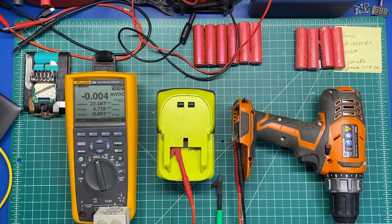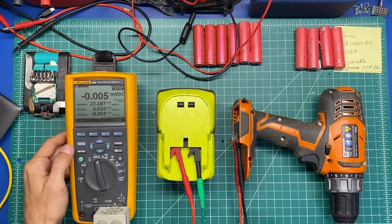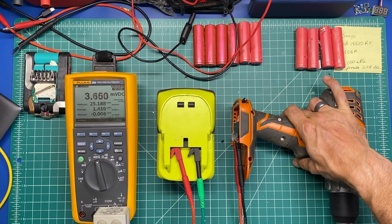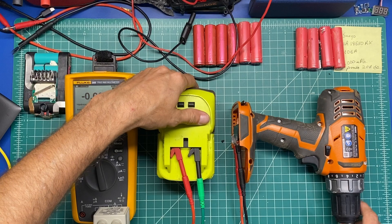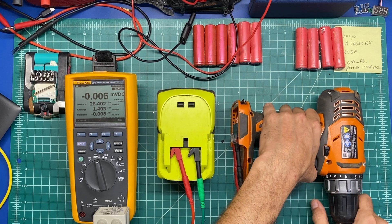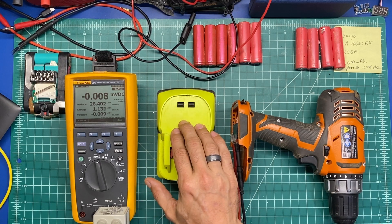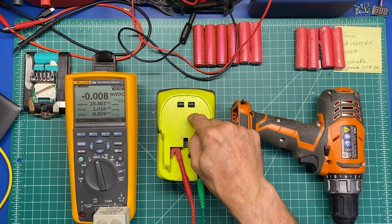So where is this battery cutting off? We know we're not going to go over 30 because this battery will cut off way before then. Let me reset this — 23, 25, 28 amps. Now this battery's not going to cut off on me... it cut. Not only did it cut, it cut under 28. So I think it's an overheating thing — putting out too much power. I mean it's capable of putting out that power, it's just after a few pulls on the trigger it seems to overheat and the MOSFET cuts it off.